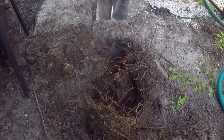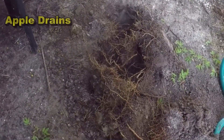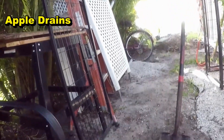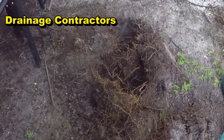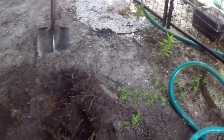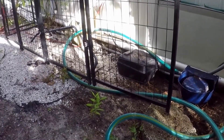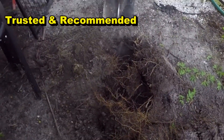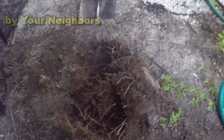When you're digging this yourself as a do-it-yourselfer and you come across the shaded area, you can see all the trees here — there's lots of trees. You're going to have roots, especially if it's all shade. You can see this is a low spot; it runs uphill and water floods back up underneath that slab and underneath that awning, ruining the inside. So you've got to get a drain over here.